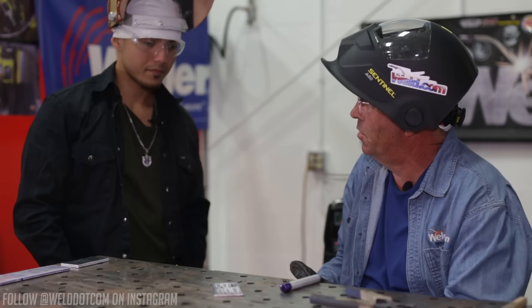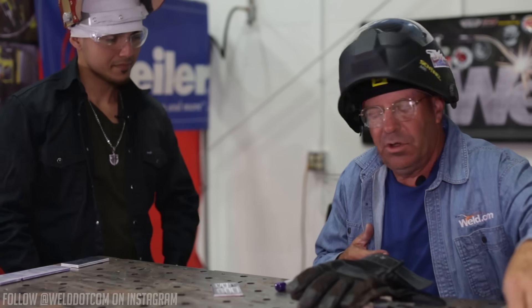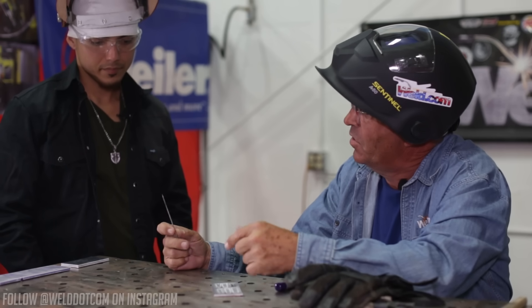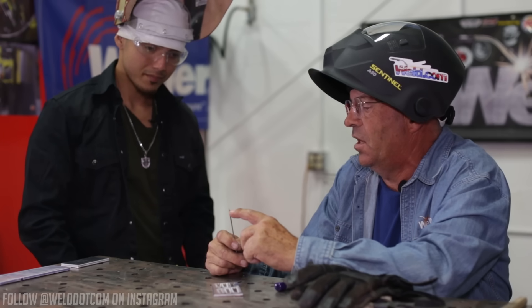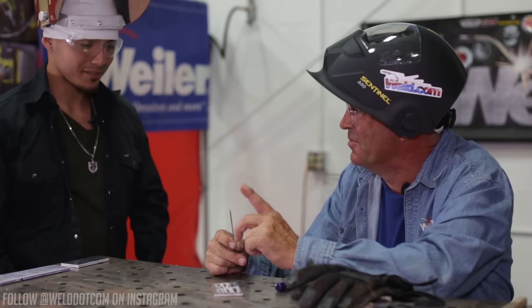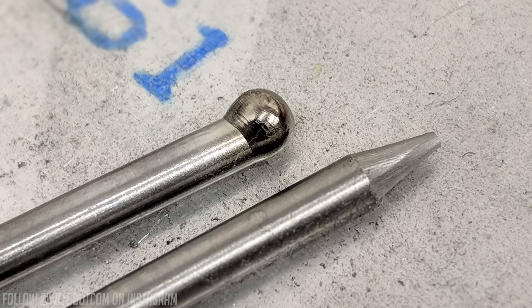Look at this cool tungsten holder - Shea Spec built some cool stuff. We both like using that sharp point. But you can see just from settings alone it's going to go away on alternating current if you exceed the current carrying capacity. It could spit, and if it spits, your tungsten just went into your aluminum - that's not cool. Sometimes I'll prep a tungsten and then the last thing I'll do is blunt it right on the end - just make a flat point on the tip.